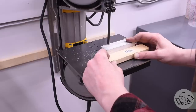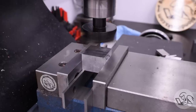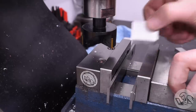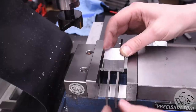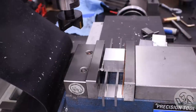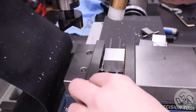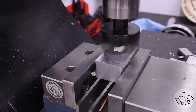I rough-cut these on the band saw — four of them to length, but I screwed one up, so I ended up with three, which is enough. I faced one side of each block to get a reference surface, then needed the other surface to be parallel without machining the whole block. To set it up in the vise correctly, I've got a piece of round bar on the fixed jaw and copper wire on the movable jaw, so only the parallels influence the position against the mill. Something round or ductile eliminates the influence of the vise jaws — important because the sides of the aluminum block aren't square to the machined surface, which would over-constrain things and prevent a parallel surface.